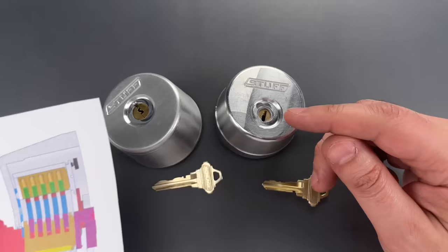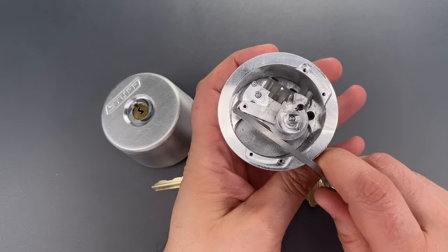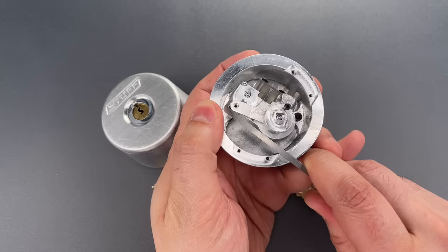I'm going to try to get around that by inserting a thin piece of metal between the door and the lock housing, then slide it up until we're over the top of that upper core, and then pull down, which should tension the upper core. Once that happens, I should be able to pick this as I would a normal lock.